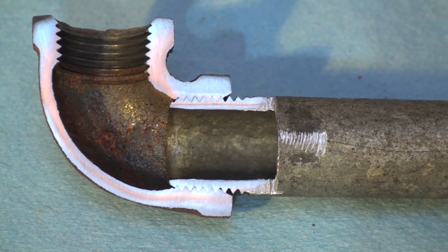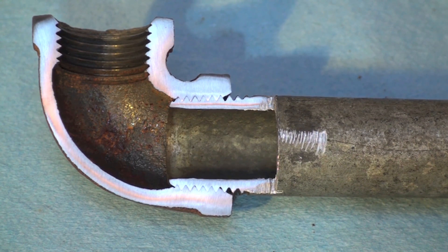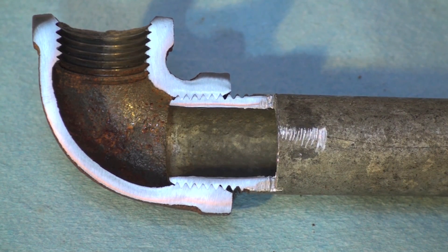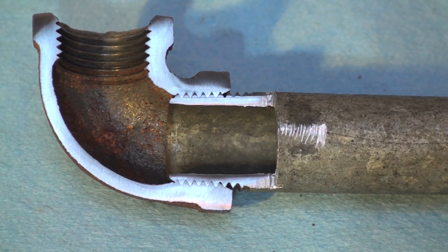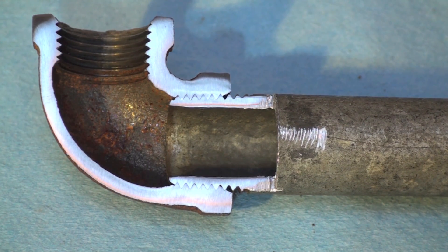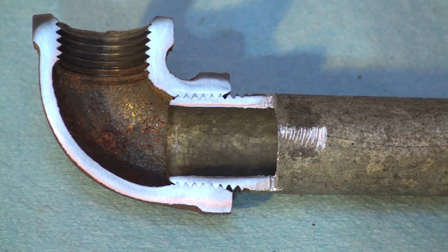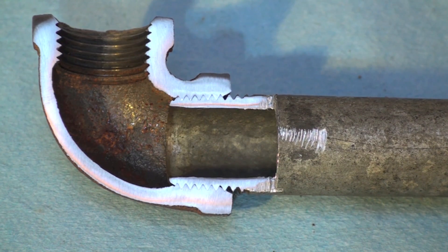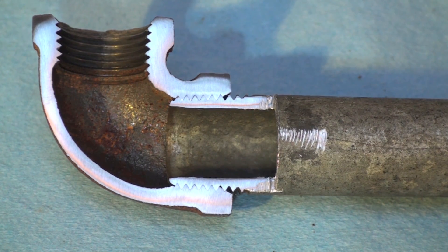Jam them together — this is actually one of the best ways to join pipe that I've ever seen. It's interesting because it's probably one of the oldest ways we've joined pipe together, and it is a very, very good seal. I've had better seal with tapered pipe threads than with anything else. As the pipe gets bigger, it gets harder — they don't seal as well as they get bigger.